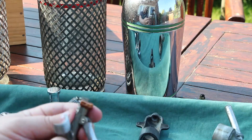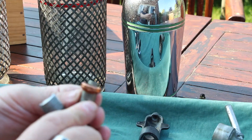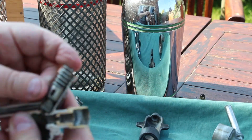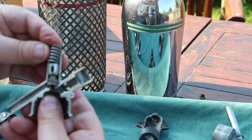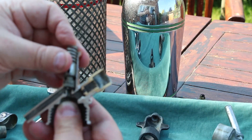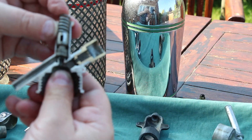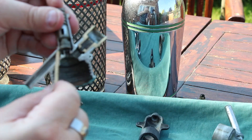When you rebuild it you have to compress that spring and apply the copper cap and crimp it all down — the spring is quite strong — holding it all in place. Operating it, you can see it basically just goes up and down, lifting the piston seal up and down to allow the soda water to come out over the top of that.